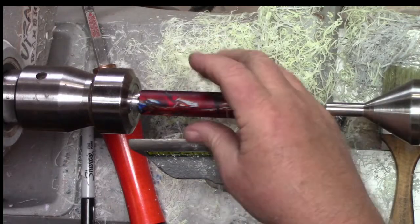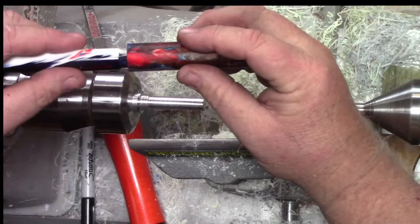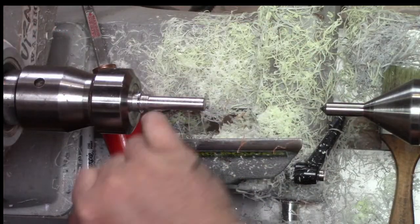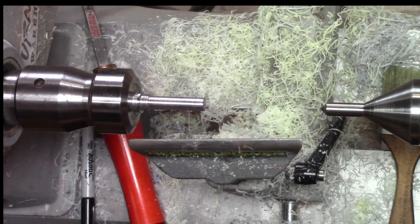So when you saw that stop, well, it stopped. Honestly, it may not have. This mandrel's really, like, the threads are almost non-existent on here. I don't know what I had going on. So the threads are still good. It's just these are so flat. I'm not sure what the deal is with these. I need to make a new mandrel for the M13.